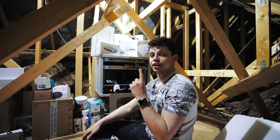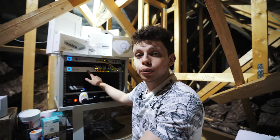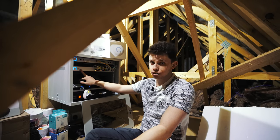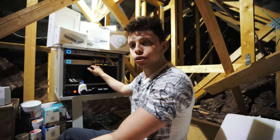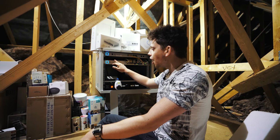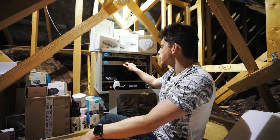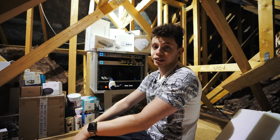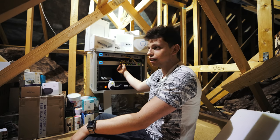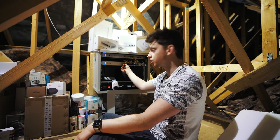We are now up in the loft. This is the switch that all of the access points connect to — the two in-walls downstairs and the HD unit in the office. This is the UniFi Switch 24, 250 watts. If you aren't educated in networking, you'll wonder why a switch needs 250 watts — it's because this is a PoE switch. PoE means that as well as transferring data through an Ethernet cable, it can also supply power. So all three access points, through one single Ethernet cable, receive the data to connect to the internet and give out a network name, as well as power the access point itself — which is super cool.